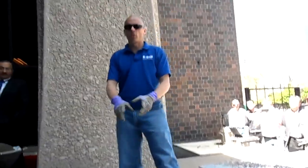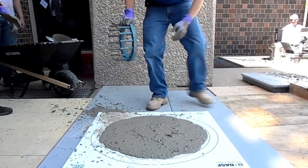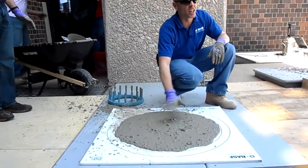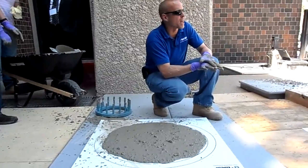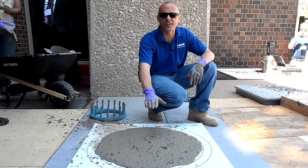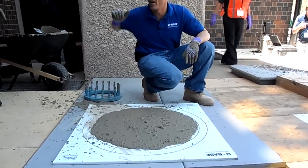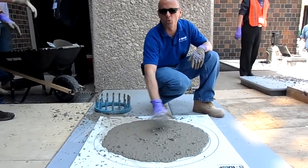Now the other thing we do with the ASTM test is we'll pick up the rig. What you want to see is if there's any difference — if there's anything piling up in the center. There's a little bit — you can see a little bit of a crown — but you're not seeing a lot of blockage between the reinforcement. Remember what this test tells you is when you have 12 inches of concrete height, when you're pumping concrete, how much more force is coming out of the end of that hose, pushing through that reinforcement. We want to make sure it's not blocking significantly, but if we see a little bit of this, we're not concerned about it.